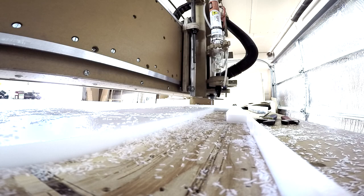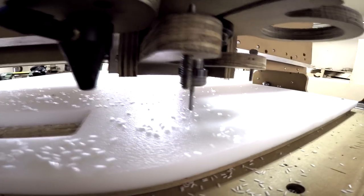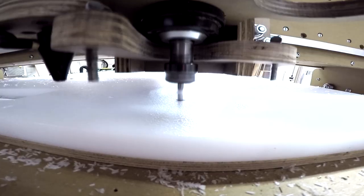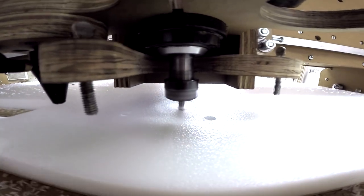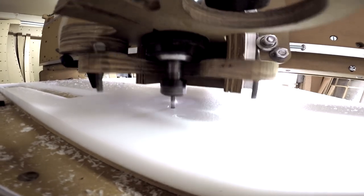So we need to make sure that the machine is running fast enough so it doesn't overheat, and at least slow enough that it has a good surface finish on the edges. Yeah, so the feed rates came into consideration on the melting of the material. And right, how many passes did you do on the cutting? You did some test cuts?